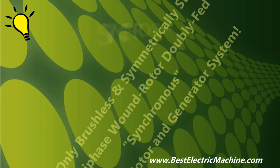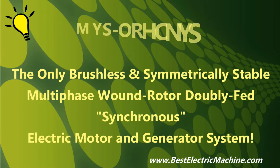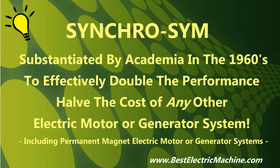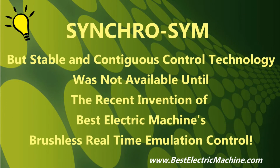SYNCHRO-SYM is the only practical, brushless, balanced multi-phase wound rotor, synchronous, doubly-fed electric machine system that is symmetrically stable while motoring and generating. Surprisingly, SYNCHRO-SYM's transformational improvement in price performance just demonstrated was already theoretically substantiated and published in the 1960s by academia, but the development of a practical synchronous doubly-fed electric machine system was essentially abandoned, after realizing the necessary enabling invention of a brushless, sensorless, and automatic control means to eliminate instability, particularly about zero or synchronous speed or during motoring, as only provided by SYNCHRO-SYM's brushless real-time emulation control, or BRTEC, was beyond the technology of that time.